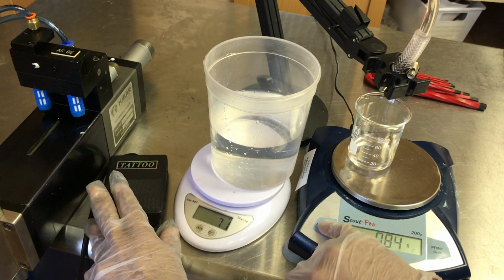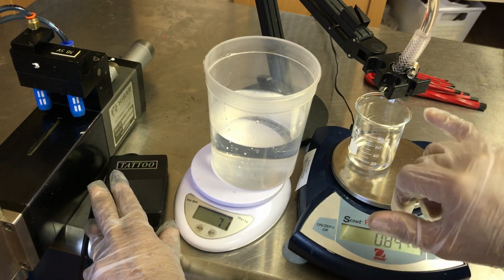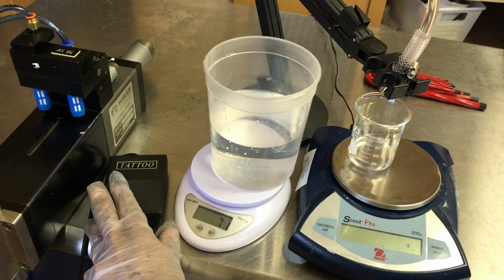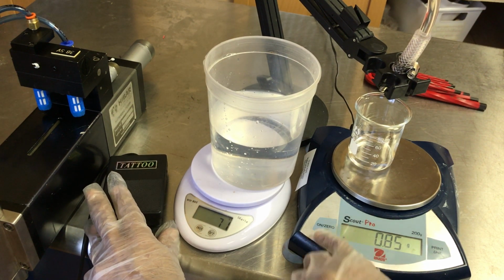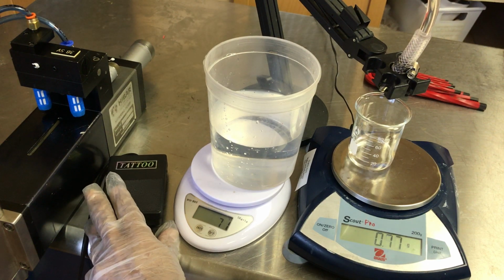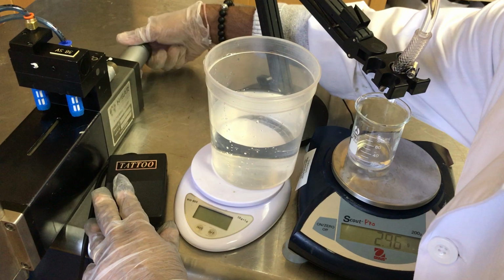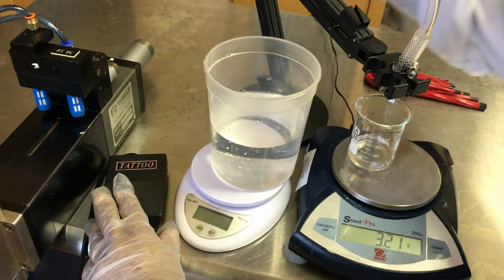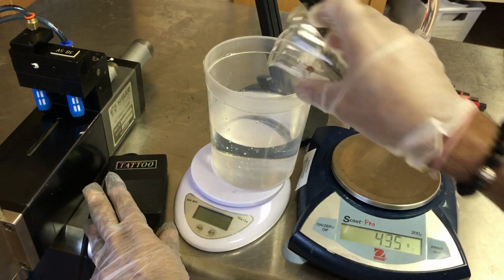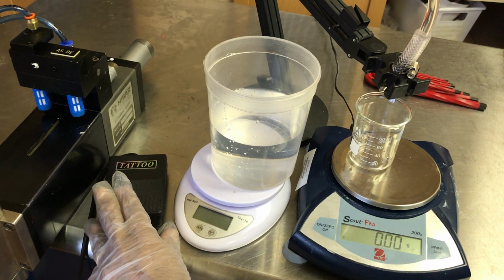What's amazing is this is to the 100th of a gram fill. And any little tiny bit on the end can make that 100th of a gram difference. But the machine is doing its job perfectly and sending out a stroke that will fill 0.84, 0.85 grams. We'll open it up a bit. And so you see it's filling at incredible numbers, 0.85 kind of thing, as well as 118, 117 very accurately.